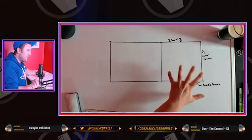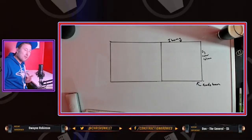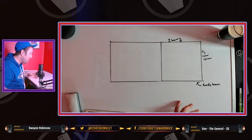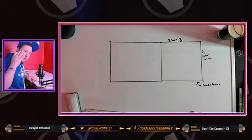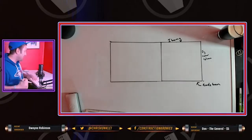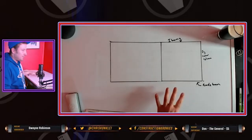On an exterior wall, it really doesn't matter what the interior looks like. There are so many things you can do to fix the inside of a wall, but there's not a lot you can do to fix the outside. If it's a serious change from the drawing, then tell the superintendent: listen, the structural steel, the iron, is messed up here, so I'm going to bring out my steel stud so that the dense glass goes flush, so the cladding guys can get their Z bar on. Don't worry so much about the inside of it.